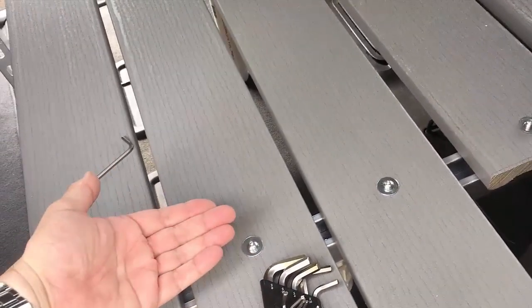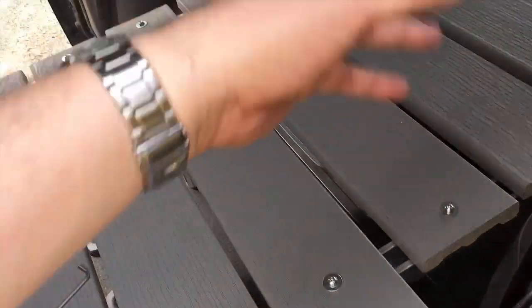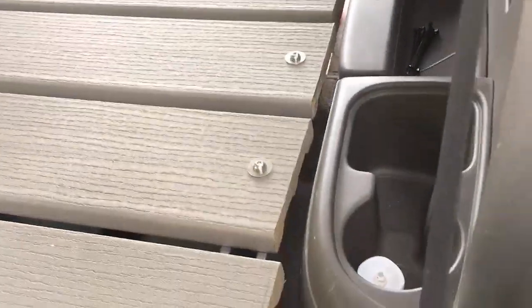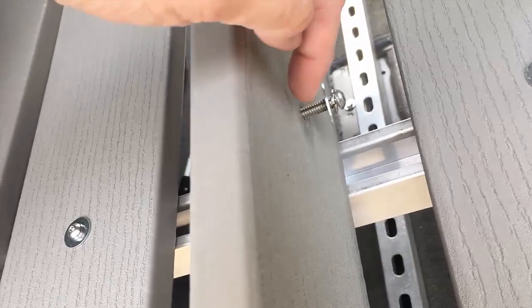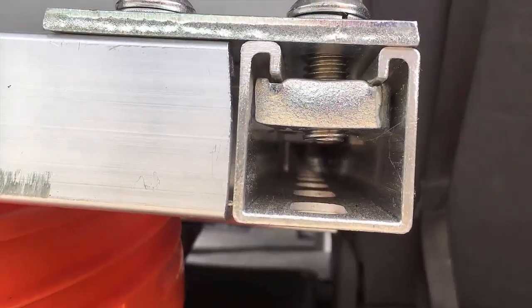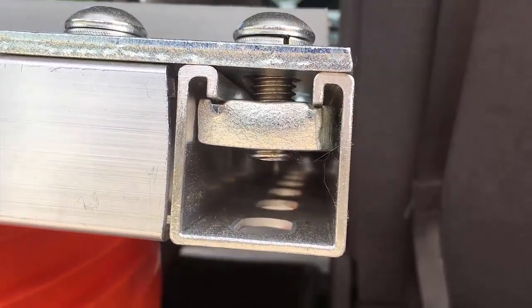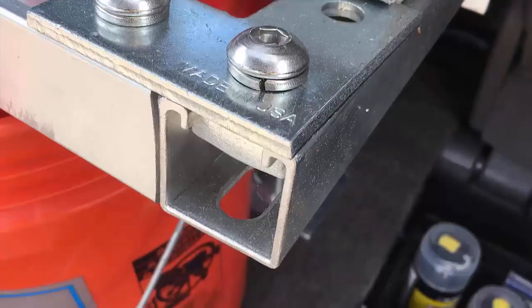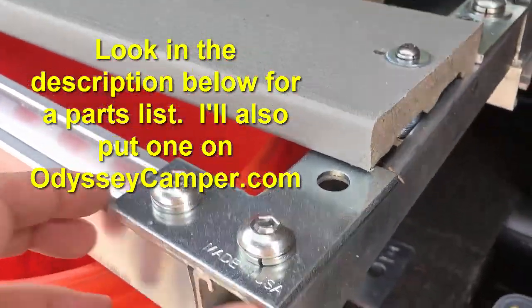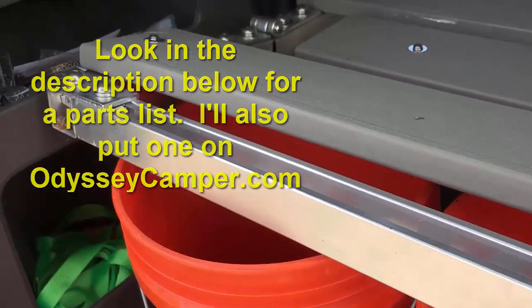In the wintertime it'll actually get cold. I use an air mattress in the wintertime, and the air mattress will insulate it to a degree, but as it warms up you get a little condensation. So it's good to have some breathability through there. You can also see how I trimmed the corners to make maximum use of all the edges. Do they line up perfectly? No, because even though I cut them perfectly, once you put the Unistrut clamps back in, because of the clearance in the hole, you might be off a little bit side to side. This end view shows you how those nuts align inside and fit in the Unistrut. The bolts holding the corners together are larger than the screws holding the planks on — these are heavier-duty bolts to hold the frame together. These are manufactured components; you just buy the component and go.